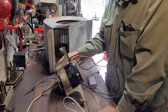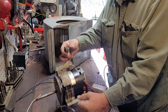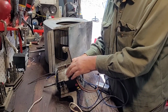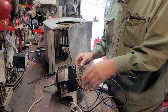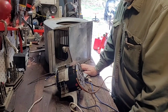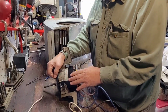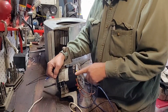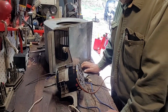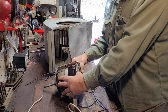And this belly band is important where you strap it. Usually you're all right if you go about dead center. This one was a little bit off, so we're probably going to slide this a little bit farther this way. And it blocks all your specs on your motor, so you might want to make sure you write them down, because you won't be able to see them once you put your belly band on. These caps here are usually oilers, so when you install the motor, if it has self oilers, always make sure that the oilers are going to be facing up. With that being said, now we'll go ahead and put it back together after we move this belly band up.